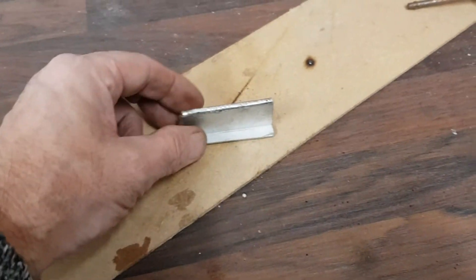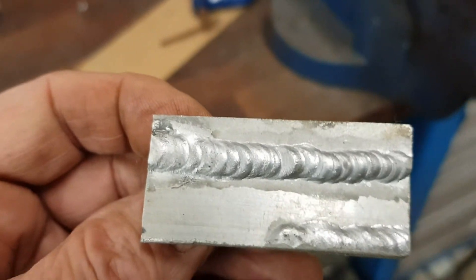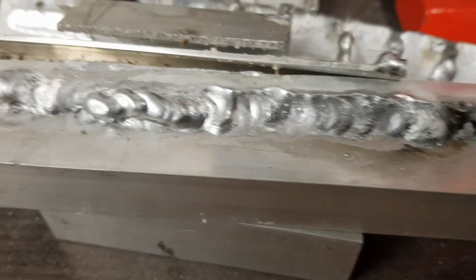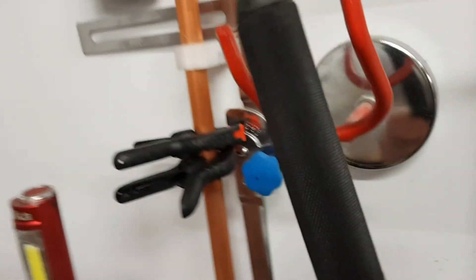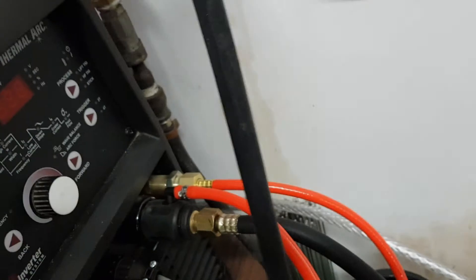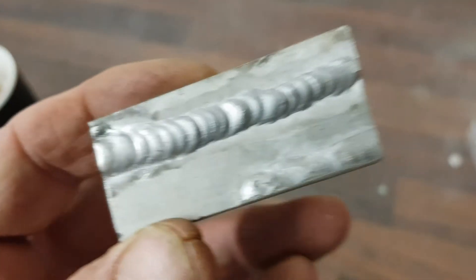Just an add-on really — just to tell you the foot pedal's worked fantastic. I'd set maximum current to 85, minimum at 10. I've done a lot of stainless welding and mild steel, but I've never done Ali before. I'm getting there. It's gone from using the normal torch — the 26 torch with the adjuster on — and I've gone for the little size 9, which has no trigger or anything on it. It's just a little torch, which is great, because you've only got one single hose on it, so you don't have any problems with the weight. That's without any filler rod, and that's with filler rod joining it together.